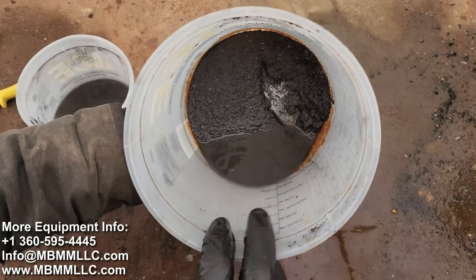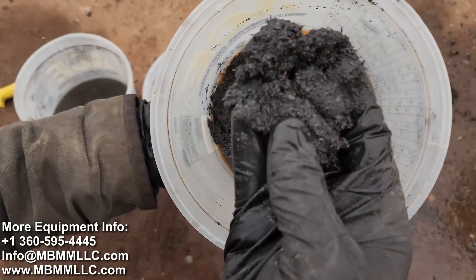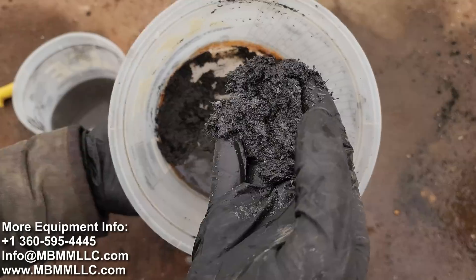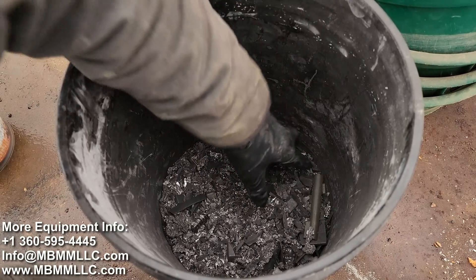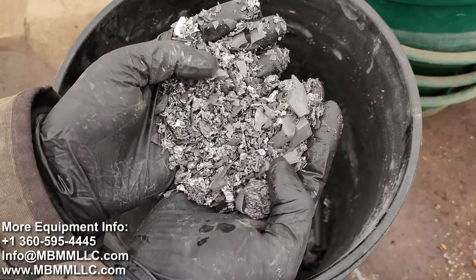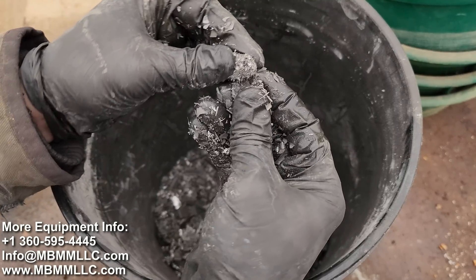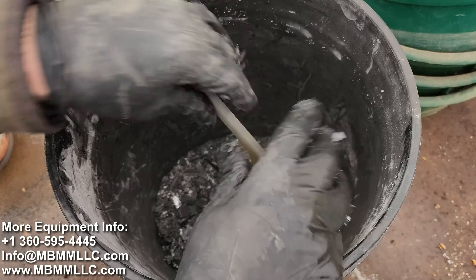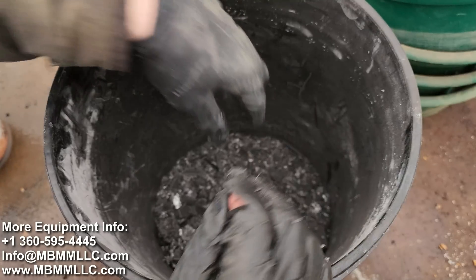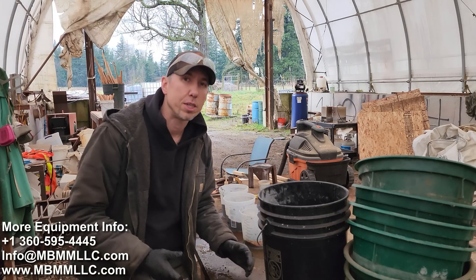Here's a little bit I caught in the number four tailings — that is just straight carbon fiber or resin, waste, there's no metal in there at all, and the container doesn't weigh hardly anything. Then here's the stuff we screened out earlier — I'm going to send it back to the customer as-is since it's everything that's eighth-inch and larger. A hammer mill would do a great job of breaking up all this material, shattering the plastic, making a really nice slurry that would go right down onto the shaker table and get cleaned up quickly.